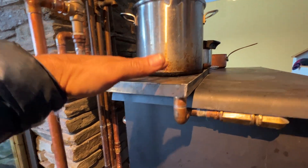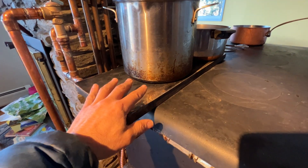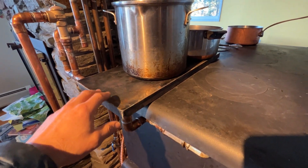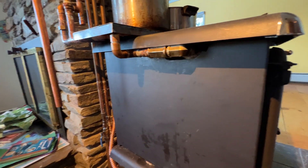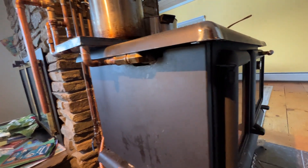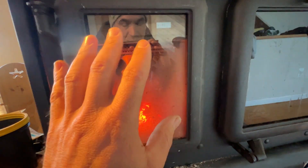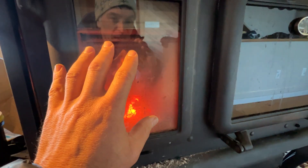These flat plates horizontally — you've got to be really careful. That slows the thermo siphon. I'm not done modifying this system because that slows the thermo siphon up too much. When you start the stove, I need to dump a little water to get the thermo siphon going, which is not ideal. I've never had to do that in my other systems, but this is producing more hot water with a very high efficiency burn and I'm not sucking any heat out of the firebox. You don't want to do that because a high efficiency burn depends on super high firebox temperatures.